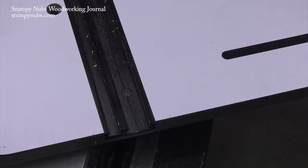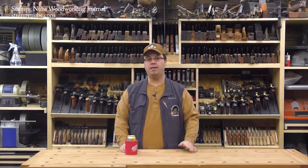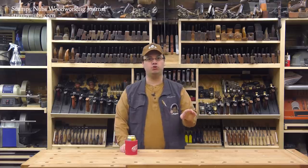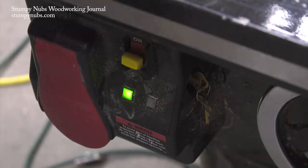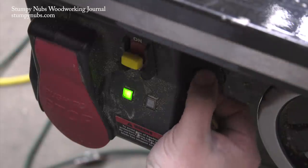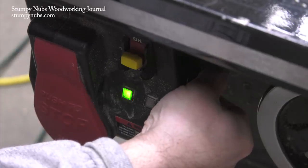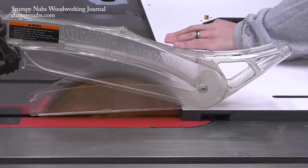This is a phenolic top — very stable, a rock-hard synthetic resin — and there's also aluminum T-track embedded inside. You can cut it with a regular table saw and carbide blades, unless you have a SawStop, because that aluminum will trigger the safety system and cost you about $200 in a new blade and brake. Fortunately there is a way to disable the safety system on a SawStop — it just takes a series of steps designed to make it inconvenient.